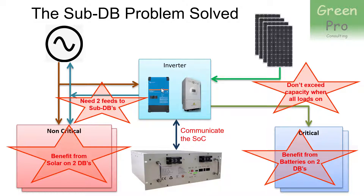For example, taking the Victron inverter, the relays can switch about 60 or 80 amps, but if you're on battery power, you can only feed 20 amps out of it. So you can't just take everything and put it there — you'd overload your inverter because you've got a geyser, a stove, or whatever on your inverter. You've got to make sure that you don't exceed the capacity, but you want all loads available when there's no load shedding. So it becomes a bit of a complicated problem.